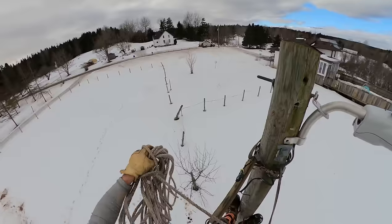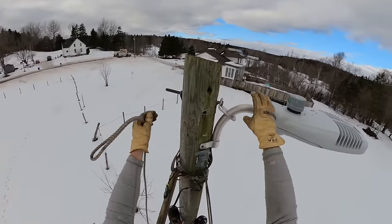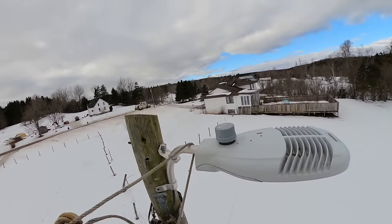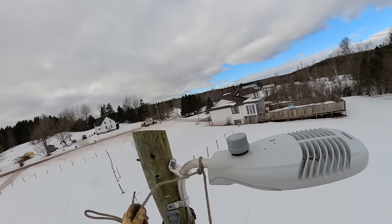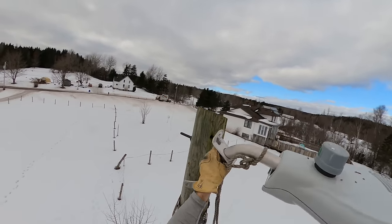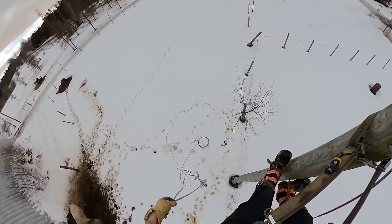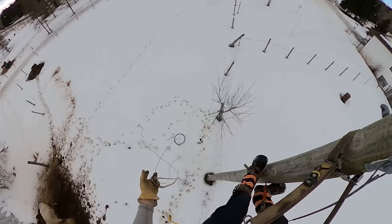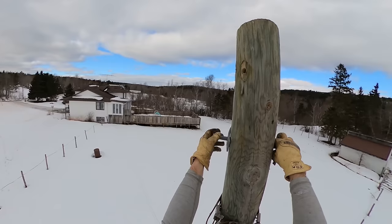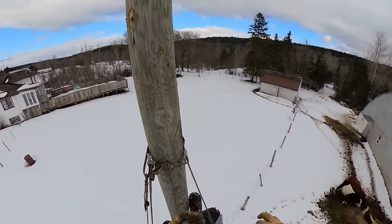See how freely that hand line fell with the way I had it done up. If you're ever lowering stuff from a pole with a hand line, it's a whole lot easier to tie your hand line on while the pole's holding the weight for you. Just fast-forwarding through - I'm taking all the hardware off the pole. Our pole crews do bill us extra if when they retrieve the pole from the ground there's any extra hardware left on it.